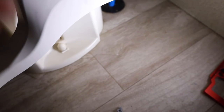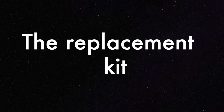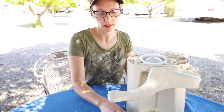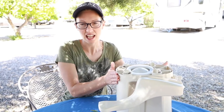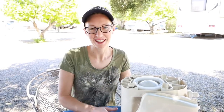This is another problem that we're having — it's leaking water on the floor whenever we're flushing it. The kit we purchased includes the entire base pre-assembled as well as the two o-rings you need and the bolts for installing it to the floor and the ceramic bowl above. When it comes to toilet issues, if you're unsure what the problem is or the toilet is quite old, we recommend that you just replace the entire base and have it all pre-assembled ahead of time. Lots less stress, lots less headaches if you can just take out the old and replace it with the new.